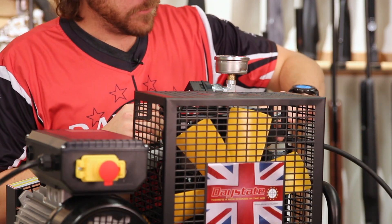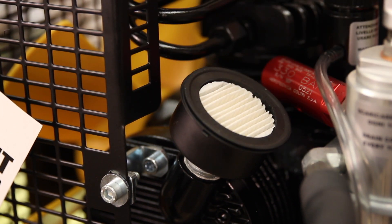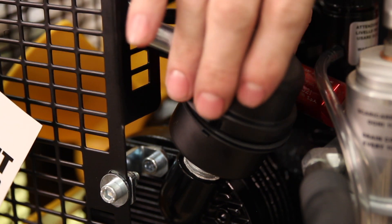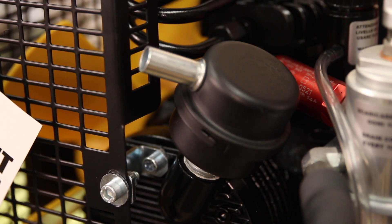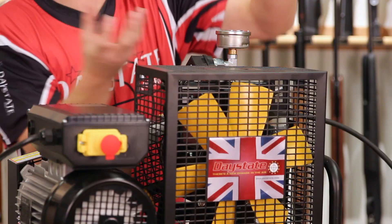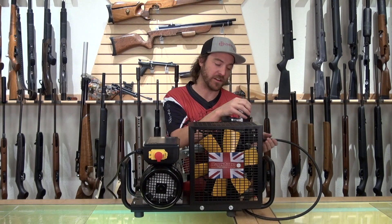Just to the left of your blow-off is your intake — this is where the unit pulls air from as it runs. You do have an air filter in here. The intake filter is supposed to be checked every 25 run hours and replaced every 100 run hours or annually, whichever comes first. The last thing attached to your water separator is the output line — it sits at the top while water moisture sits at the bottom, so gravity won't allow any moisture to get through into your fill line.